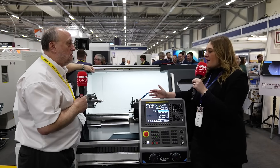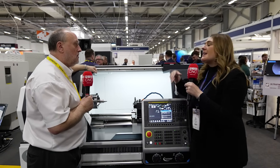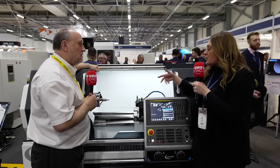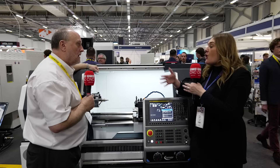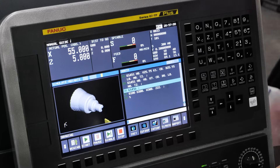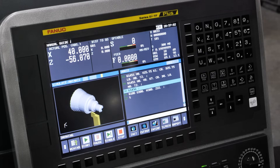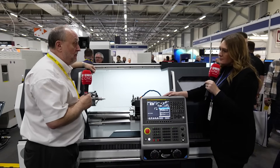Talking about tool rooms, this machine is great to be in a tool room. Basically, if you've got a component like you have in the chuck, but you want to add something like an external groove or a thread, how easy is it and how time consuming? It's very, very simple. The Manual Guide i is very easy to use — it's a conversational system. You can do it in ISO if you need to, but with a conversational system, straight in there, put your coordinates in and off you go.